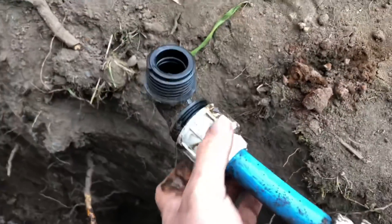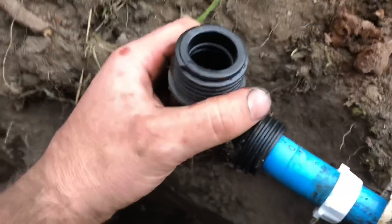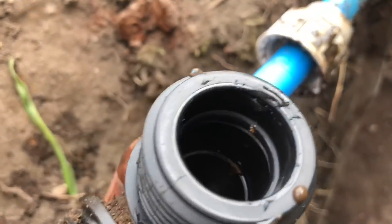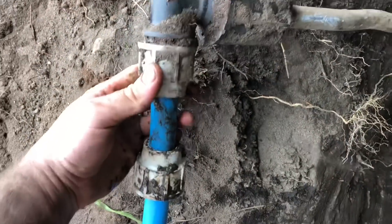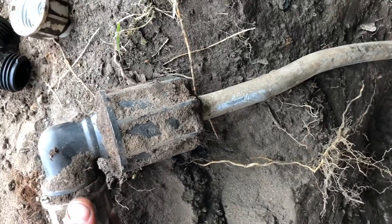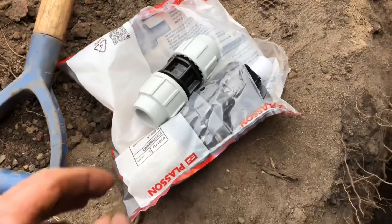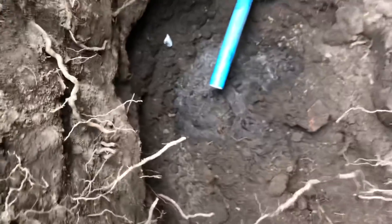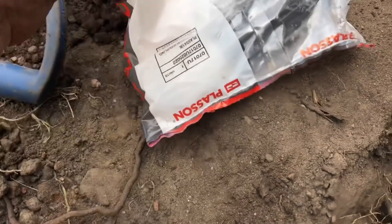There should be a little white liner in this — that's so that it stops any crushing or compression. And no, there isn't one — so that's naughty, whoever's done that. But it just means that I can get some fittings, and that there is MDPE 25mm to lead, so that's quite a handy one to have. What we're going to do is put on the new socket with a liner — that's your liner, goes in there like so — and that stops any crushing from happening. Then we're going to put our 25mm MDPE pipe onto that socket and run our new pipe, taking the old one out.